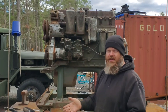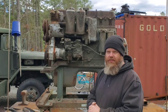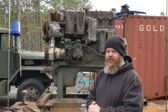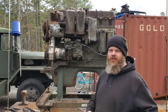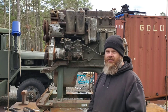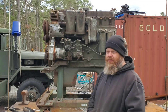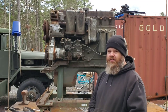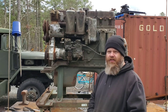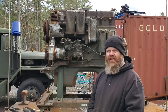The sticker said 'diesel fuel only' and mentioned reconnecting it if you had to use other fuel — because if they had to run gasoline only, which I don't recommend, it would run a lot better with it reconnected than bypassed. I've run gasoline in a pinch with a bypassed fuel density compensator and it was a gutless pig. You can still be multi-fueled; you can still run your waste oil, which I also don't recommend, but I know some of you guys swear by it — it's your truck.